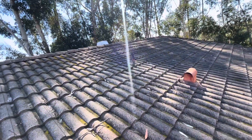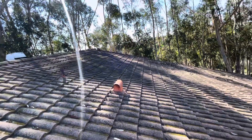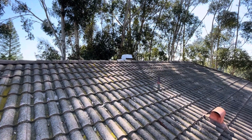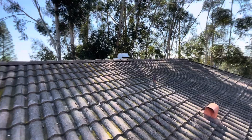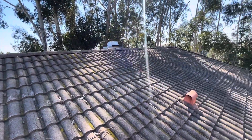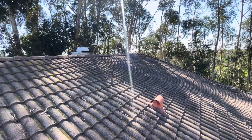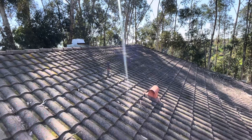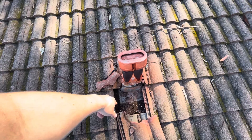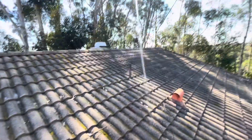The roof is right — you could do it on your roof. We could probably just do this whole side and just leave the other side alone. But my professional opinion is to do the whole roof, even in the front. Do a lift and reset, as we call it, where we lift every tile up, replace any bad wood, then put a new synthetic underlayment, and then put the tile back on. That's called lift and reset. Thank you.